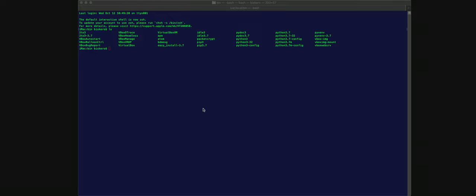Okay, so we have the CB1 installed on the PI adapter, and now we want to install the operating system, the image. You can get the image from the BIGTREETECH GitHub, and there are two images. One is bare bone, basically the base of the OS, and the other one has already Klipper and a bunch of other software installed.